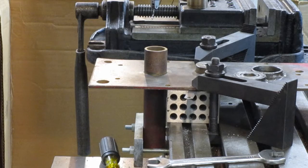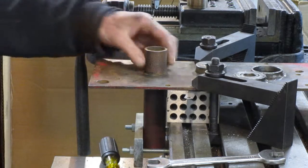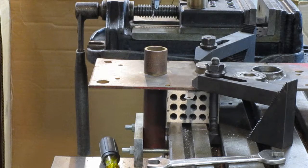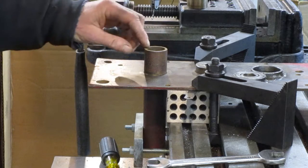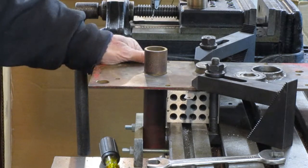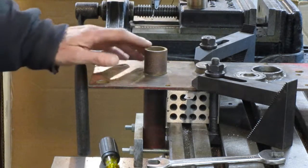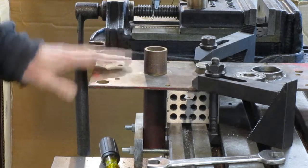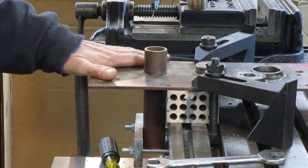So here's how I set it up on the mill. This is an old one — you can see some pitting going on here, it's been laying apart for a while. We're going to fix that. All I care about is the orientation of this tube. Since this is a fairly thin plate, just clamping the plate flat doesn't really guarantee this is square with everything. And when you bolt this to the casting, it's going to straighten this plate or change it to whatever the casting face is.